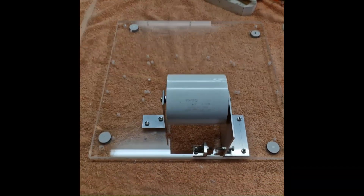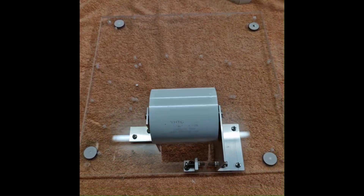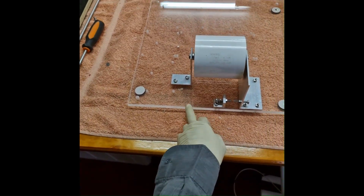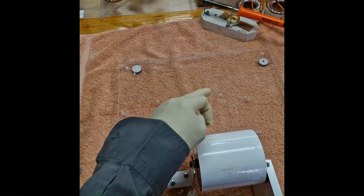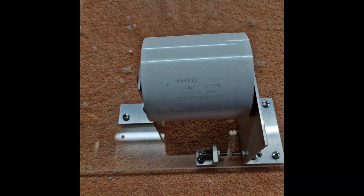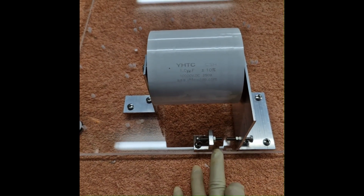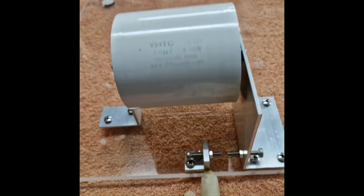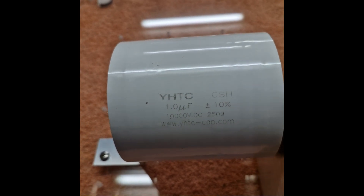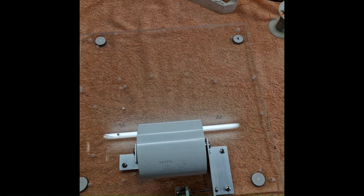I'm going to proceed to assemble the single MOT - microwave transformer - Tesla coil. We start off with the brackets on the acrylic base, already marked and drilled for the mounting holes for the various components. Start off with the capacitor stand and the safety spark gap for the capacitor. The capacitor is a whopping one microfarad or 1000 nanofarad, 10,000 volt capacitor, and all the other components are going to go on.